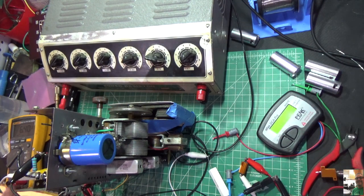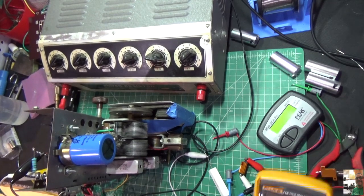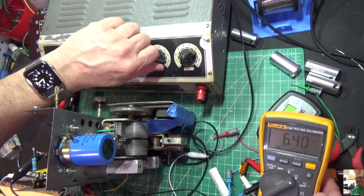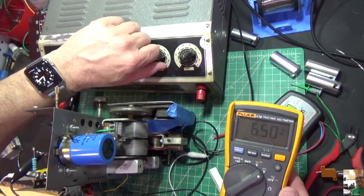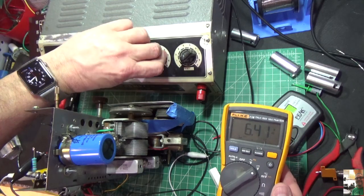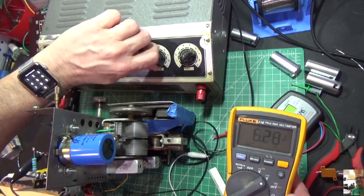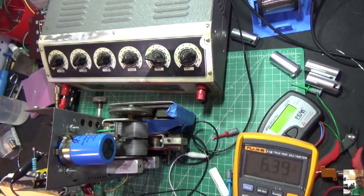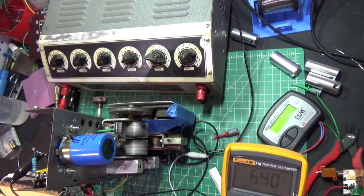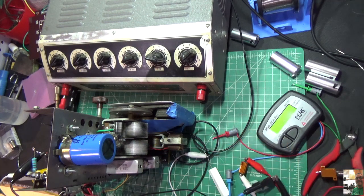So I have it dialed in at the moment at 180 ohms. Okay? Just like that. If I take this 10 scale and go to 170 ohms, you can watch the meter. Goes up a little bit, comes back down when we go to 110, and if I go up to 190, it's a little too low. So we're going to go at 180. This box is really cool, good for this kind of stuff. I've never used it on the video before, but works really well.